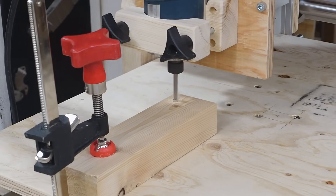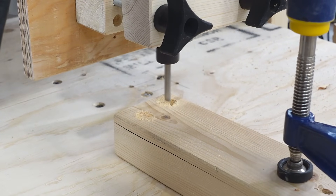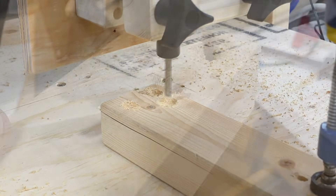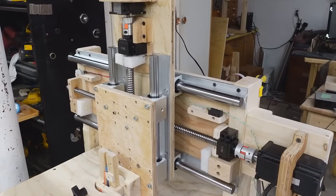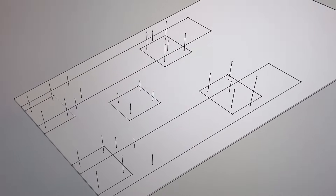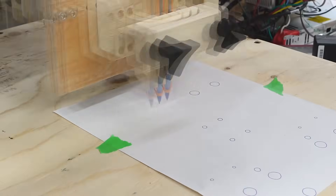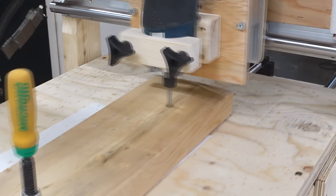Time to try a countersink in wood. Looks a bit messy. Then I tried to drill the hole by manually jogging but hit the wrong button. There's my new countersink hole and the screw fits in perfectly — that looks much better. To make this part more accurately, I drew the layout in SketchUp and used vertical line segments to represent hole positions, which are easy to parse out of the COLLADA file without actually understanding the format, using just a simple Python script. I modified my pen holder to go into the router holder and started by drawing the layout on paper, then tried it in a soft piece of scrap wood, and finally in the plywood.